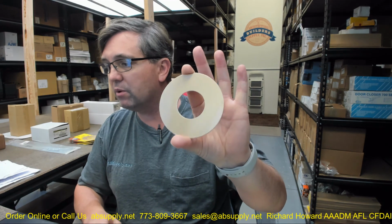The point of that is, I'm sure it's .032, so you're adding a 1/16 of an inch thickness, and every lock that you're going to buy is going to tolerate. Plus, if it's a wood door, and it probably is, if you put a caliper on a 1 3/4 inch thick door, it's not 1.75. It can be, but it's not. It's 1.71, that sort of range. So you're going to be right where you need to be with this.